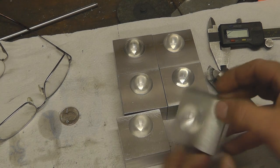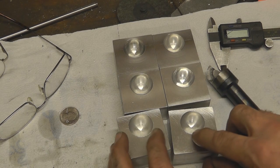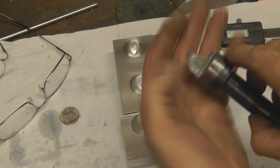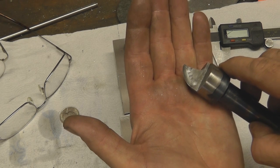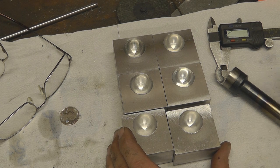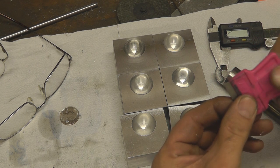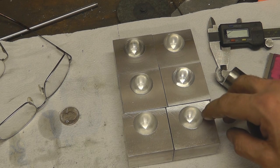It did leave a small lip of material on our mold block. I think the reason is that as it cut down and pushed that metal out, there's a spot where when I dished this out with a 3/4-inch ball end mill, I did not come close to the edge, and I think that left a dull spot, which is why on these blocks it left a little bit of ridge of metal around the hole. That is no big deal — what I will do is take this razor scraper, which holds an old-fashioned flat razor blade, and scrape around the circumference of these holes to clean that ridge off. Then we will start turning our alignment ball to align our halves.